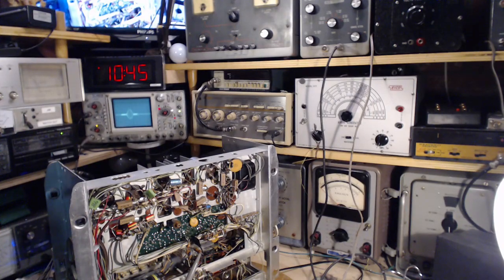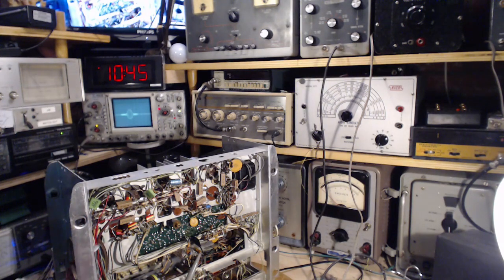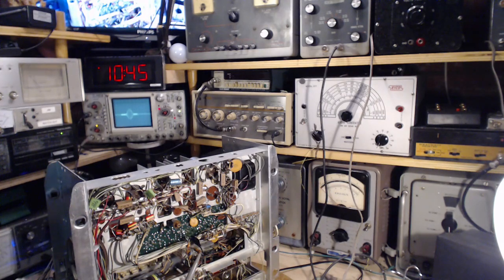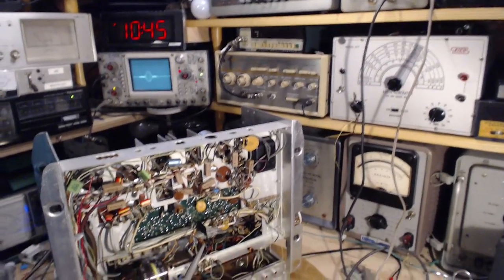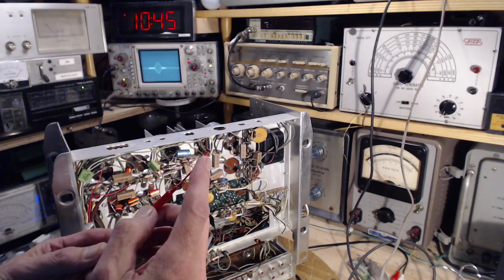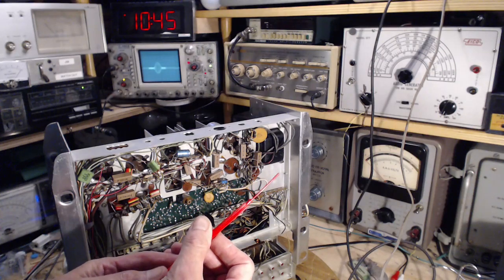Now, you wouldn't know this because I didn't post the video, but in the FM tuner, the last part is a transformer that sends the signal on its way to the IF, and that adjustment is the first thing that gets adjusted when you're doing an RF alignment. I'm going to go ahead and do that. The problem is only one slug is free, and I'm using this tool with this very slender plastic shaft. The end part here is just a little wider, a little tricky to see.